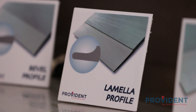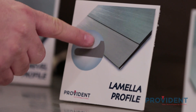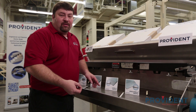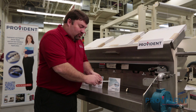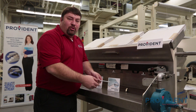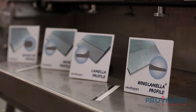The next profile is the lamella, or the stepped edge profile. This is an offshoot of the gravure industry. It features a very thin tip that allows great break-in and high resolution printing, but suffers from tip flexibility and weakness. The last edge is the wing lamella profile. This is a hybrid or cross between the bevel and the lamella tip. It features a high definition printing tip with the rigidity that allows for longer runs. This profile is cross-ground and prevents slivers and spurs of steel from getting into your ink chambers and anilox rolls. These are the four most common edge profiles available in our industry today.